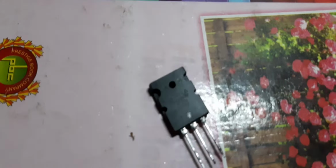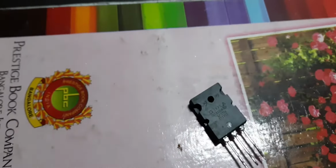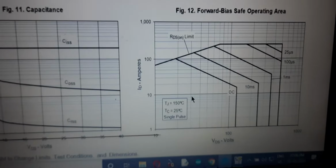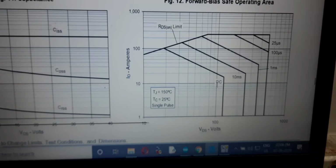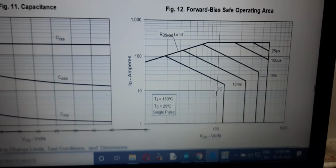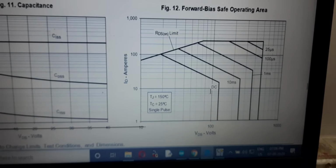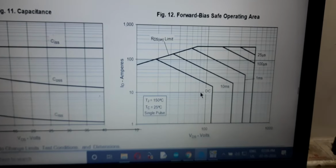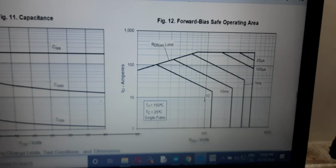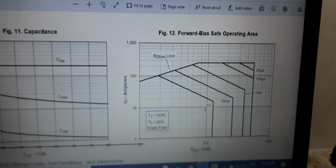And as you go to higher voltages, the MOSFET would blow up if you try to pump in more current. So at 100 volts it can go till 10 amps. That would be 1000 watts in the linear region, but it's not possible. It is possible only if you maintain the case at 25 degrees Celsius, and this condition will be possible for only a few seconds. So that's why you see serious cooling in this type of linear load.